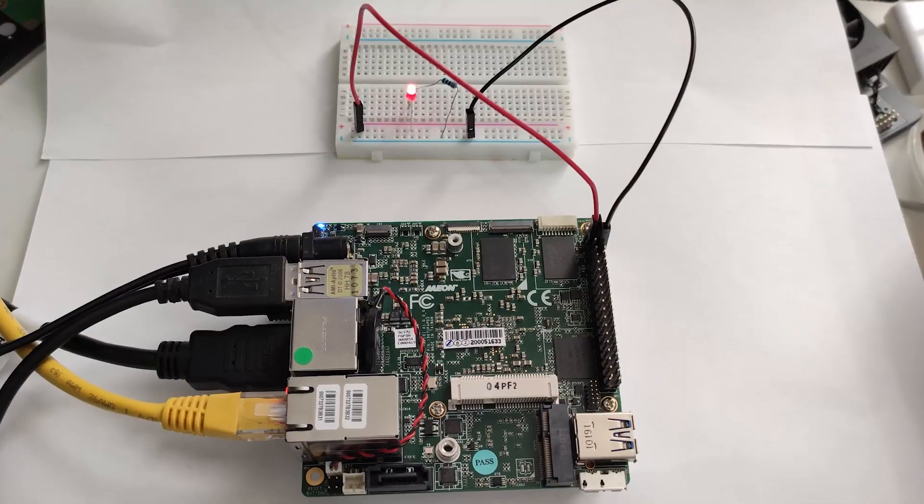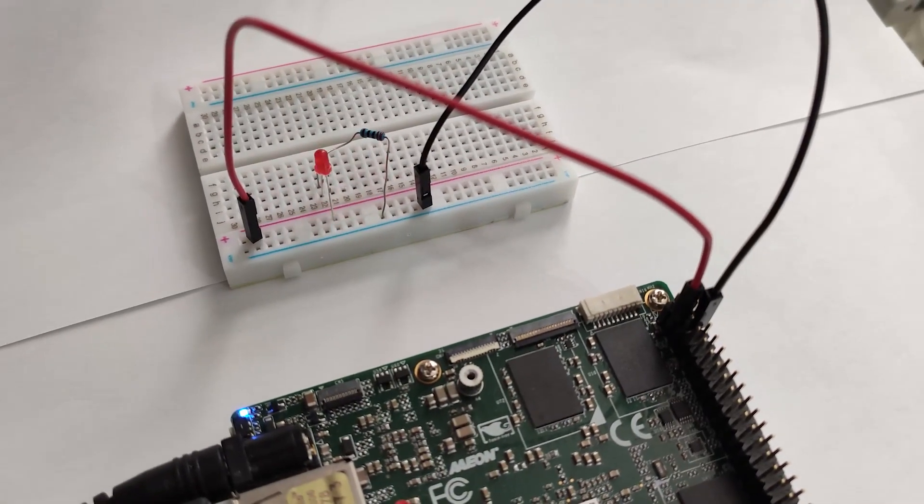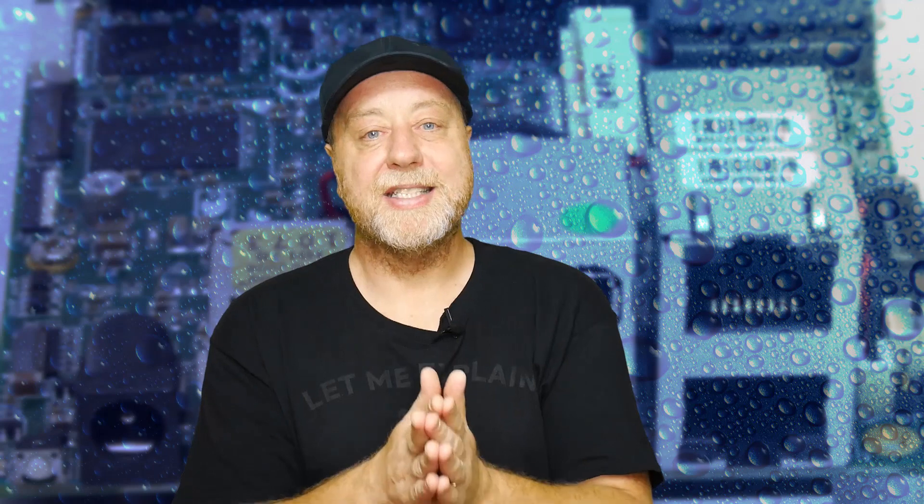I downloaded a Visual Studio program — a Universal Windows app — compiled it and ran it, and I was able to control the GPIO pins. The hello world is getting the LED to flash, which I was able to do. I also tried it under Linux. I installed Ubuntu and followed the instructions using the SysFS file system to write values to different files. Unfortunately, I couldn't get it to work with Linux, but I'm assuming it does work since it worked under Windows — probably another round with the support team would fix that. The only warning is that you might need to put some effort into finding the right configuration, but then you will have control over those 40 GPIO pins.